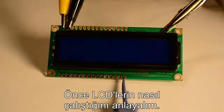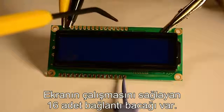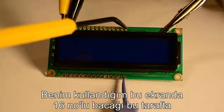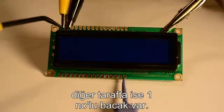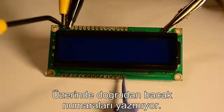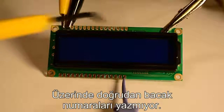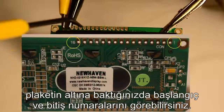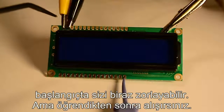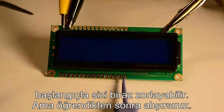Here's really the bottom line on how these LCDs are set up. They're all rather standard. There are 16 pins associated with these screens. Mine is numbered — pin 16 is here and pin 1 is there, so it's 1, 2, 3, but the ones in between aren't numbered. Actually pin 16 and pin 1 are numbered on the PCB but the ones in between aren't, so you have to kind of count. That's a little bit of a pain but you'll figure it out.